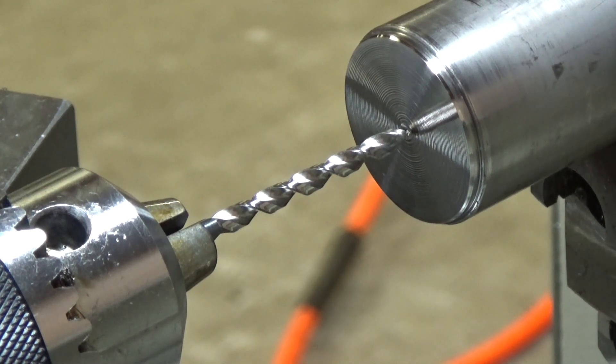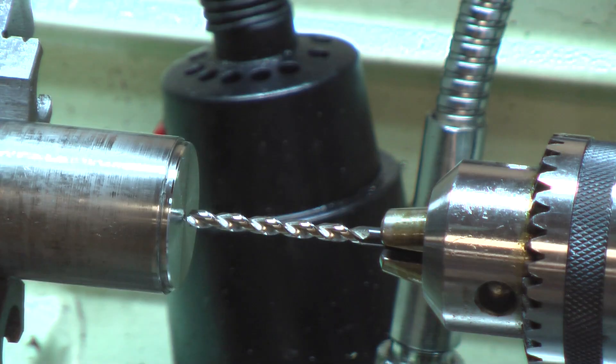This video is in reference to my 'Drilling Titanium Successfully' video, where it was still very hard, but the slower speeds worked out considerably better than 300 or 400 RPMs. I did get a viewer comment that 70 RPMs, coolant, and pecking a small hole will work wonders. Just get a curl of chips coming off, back out of it, and keep pecking away — it works much better than letting the material get hot at all. So we're going to give that a quick try here.